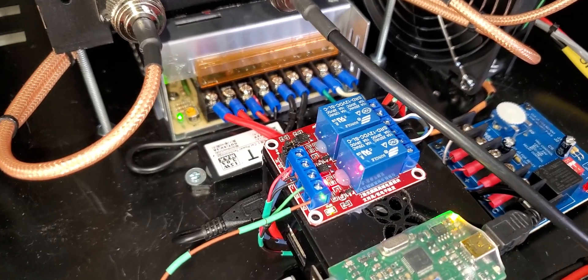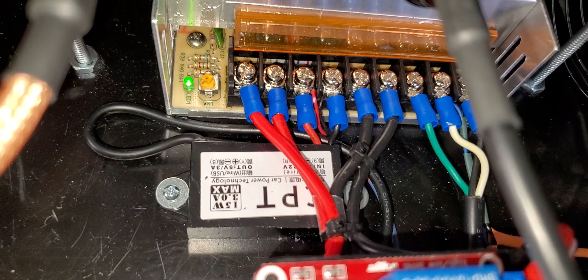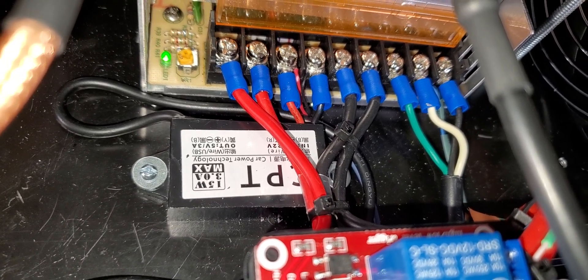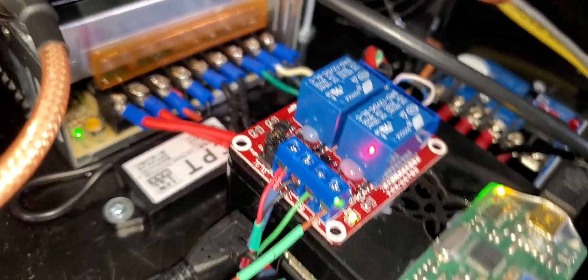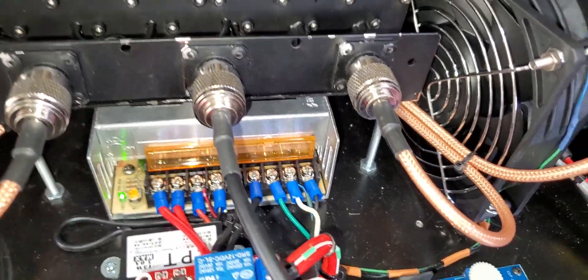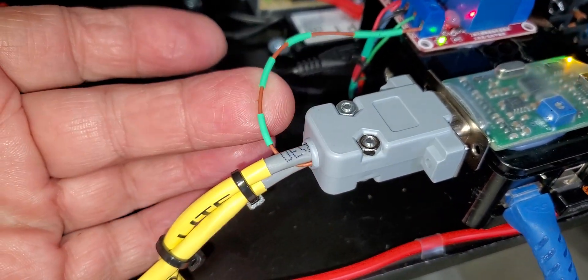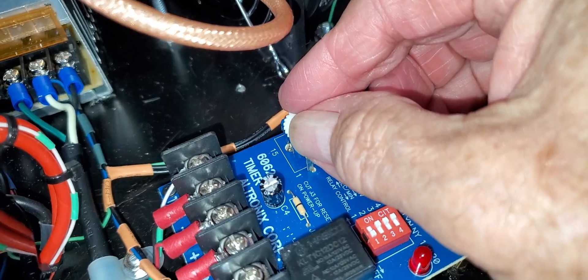The trustee will realize the repeater is turning on and off, but that's another video. That's also the connection for the switching power supply. Underneath you can see a 12-volt to 5-volt, 3-amp power converter — that's what's actually running the Raspberry Pi. Make sure you've got plenty of juice when you run these Raspberry Pis, especially if you're adding them to an actual repeater. The second leg of the relay comes from this dual relay board out of the radio side, and that triggers the relay — so when the radio gets the signal it triggers the fan.